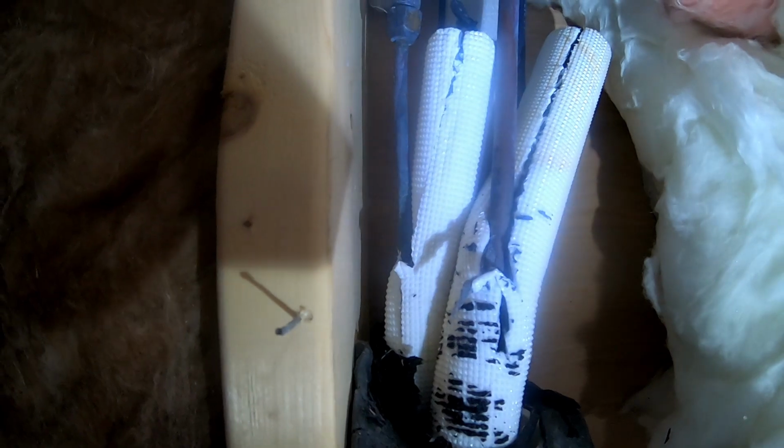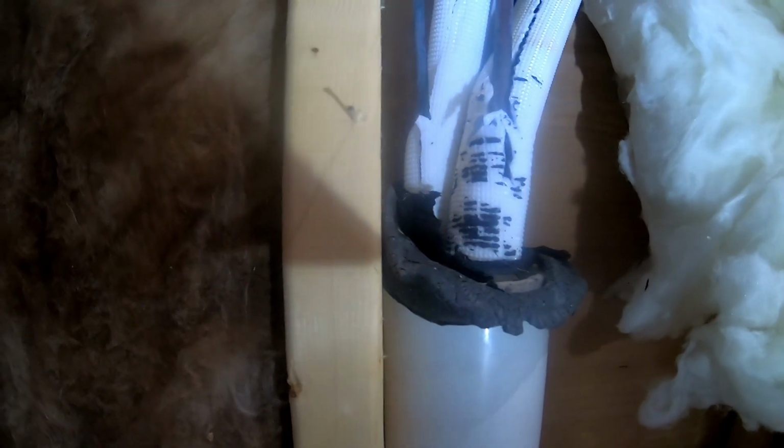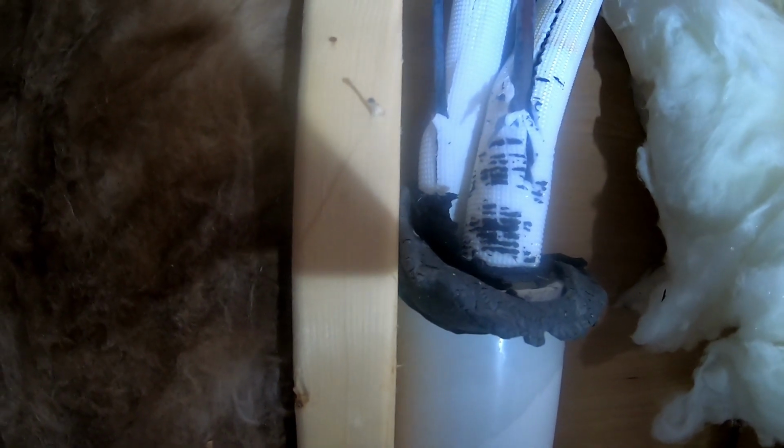It's worked flawlessly up until the summer, which was probably just about a year. And that's when we noticed the evaporators on the 3-zone system icing up a little bit. The fans were making a clicking noise. So I'm thinking, all right, maybe one of those flares came loose. I'm not messing with it in the middle of the summer. System was topped up, I don't want to say, like 2 ounces were put in. Everything was fine. Ice went away. And then later on in the summer, you could tell everything was slowly degrading again.